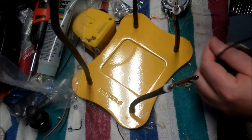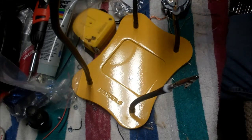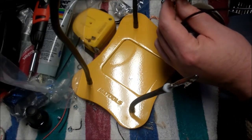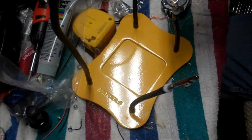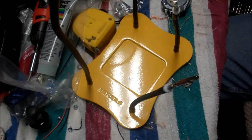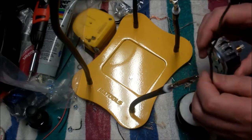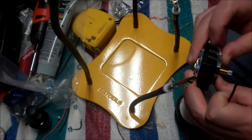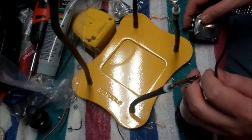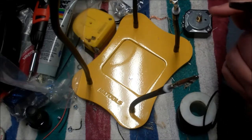Technically, because this chassis shell is earthed, I should only have to earth one of the two pins, the input and the output, because the other one will be earthed by default. So, anyway, there's the ring. That's our ground. So we'll put a piece of wire from ground to the ground, which would be pin number 1 on our L-pad. So, exciting stuff.